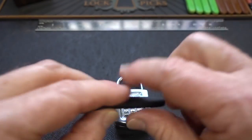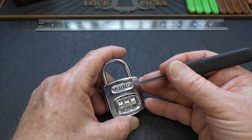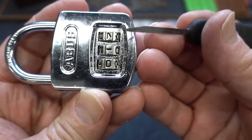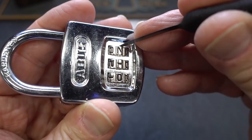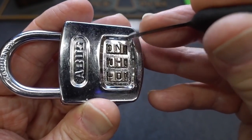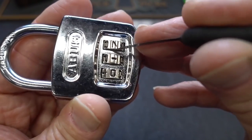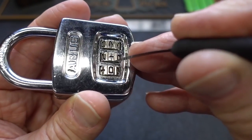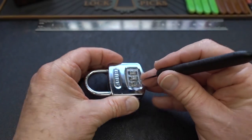If I can find my shim here — it is so easy that even someone like my brother-in-law, who's dumber than a bag of dirt, even he can figure this thing out. So what we want to do: take your shim or your feeler gauge and slide it in there and feel which side is wider. On this one, it's nice and small on one side and over here nice and fat. The left side of these wheels is the fat side, which is usually where they have the cutouts — the gates — to pick these things.